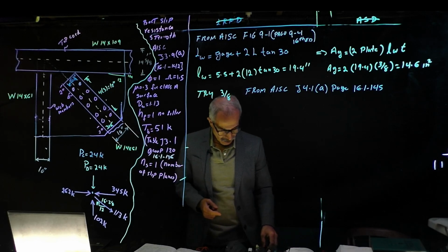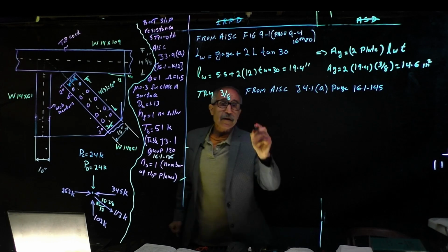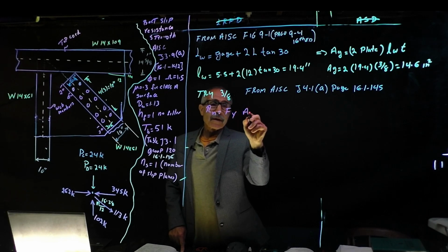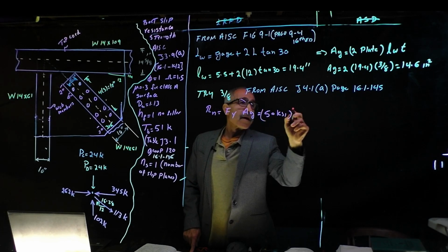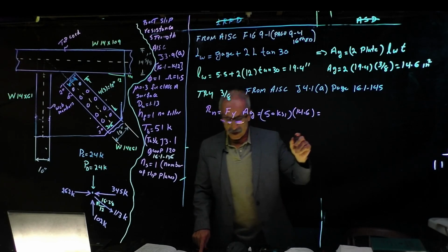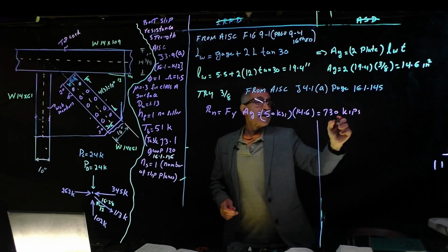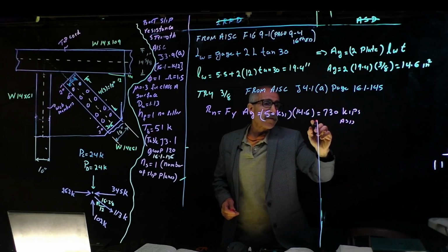So that's what we're trying to find out. And from that equation, we're going to go ahead and write down Rn is equal to Fy times Ag, which is equal, our Fy we said was 50 KSI times 14.6. That comes out to be 730 kips. All right, so now I'm going to go back and do my ASD here and LRFD this way. Okay, so I'm going to do both of them.